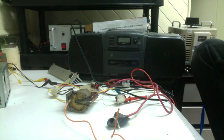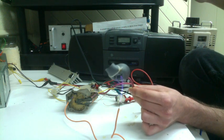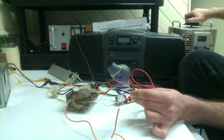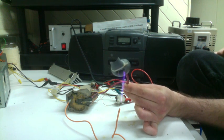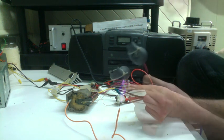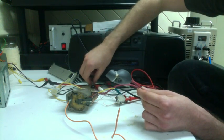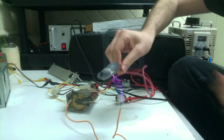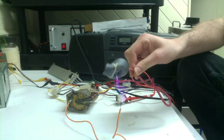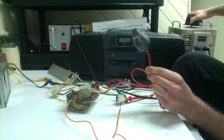You know when you get the right capacitance when you see lots of ozone and it screeches like this, from far away too. When you turn the frequency low, you get really, really spaced out, huge arcs. And that's only at 20 volts. You see what resonance capacitance can do?